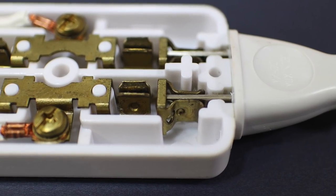Point number three: wire. The wire itself should be of high quality if possible. A good idea is to get a quality power strip and replace the wires inside with OFC, or even better OCC copper, or even silver if you want. Avoid brass bars, which are connected to the serial wiring concept — those bars have very poor conductivity and connect all the outlets. We want independent, high-quality wiring. You can replace it yourself if needed.